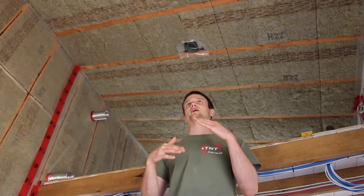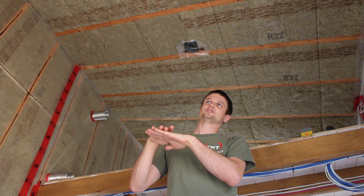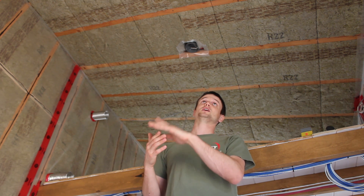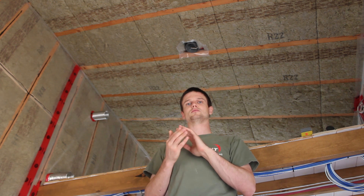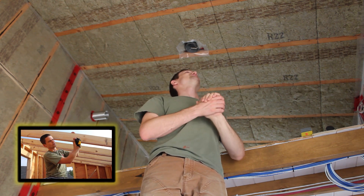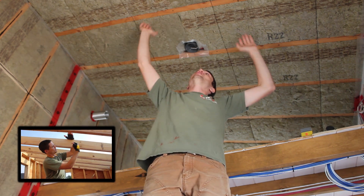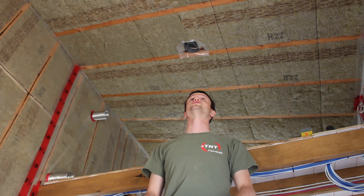There are other layers in play for sound dampening: there's the metal roof, the ventilating furring strip, and the asphalt paper - all roofing related but they're all layers for sound to travel through. Then we've got plywood attached to the roof joists with subfloor adhesive, which has a slightly rubbery finish that's also slightly dampening. Then there are furring strips furring the ceiling down to create an air gap. Adding the acoustical sealant, the poly vapor barrier, and then the ceiling, hopefully there'll be enough to absorb the rain sound so it won't be deafening, because we do get a lot of rain here.